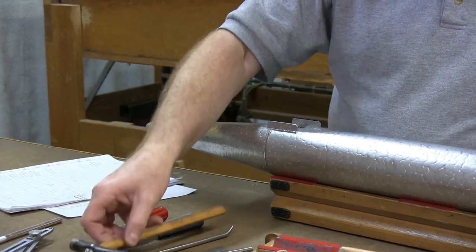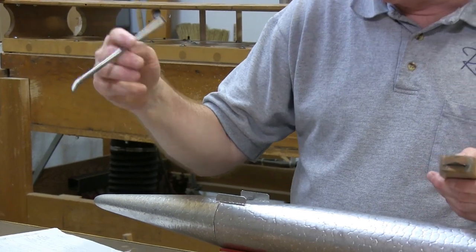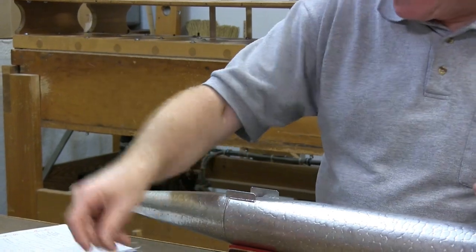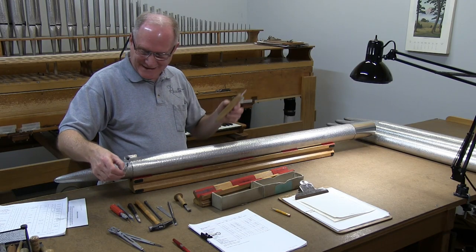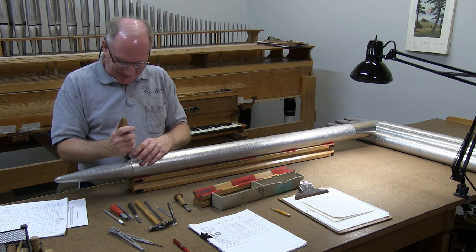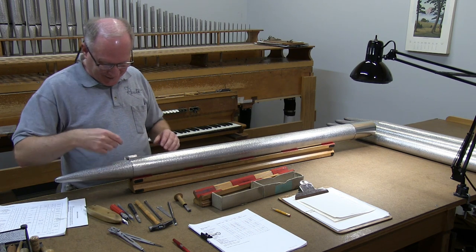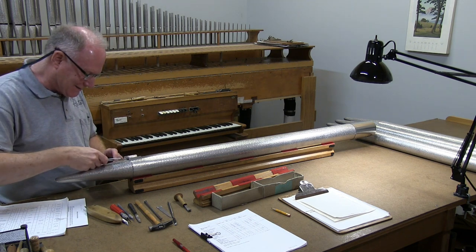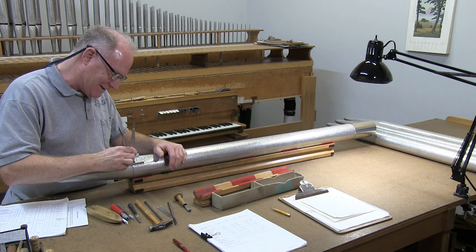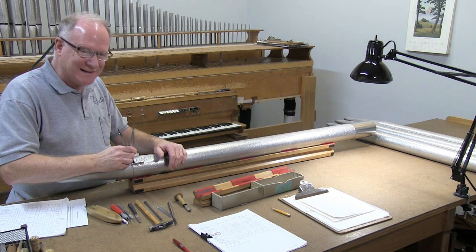This is just a jeweler's hammer. We have a foot hook, I guess we'll call it, that's just made out of a steel rod that was shaped and bent. Between the bigger one here and the smaller ones, I probably use the most. So with this, I just kind of get it started, and you shave back and forth across it until you reach that line. And then you can also double check your work. You want to go easy when you're doing this, so you should take out smaller pieces at a time instead of one big swipe.